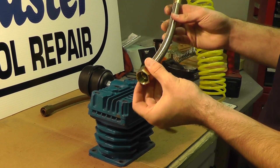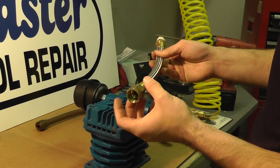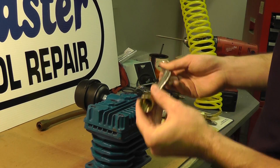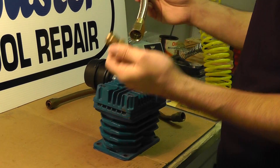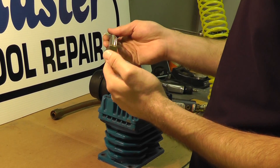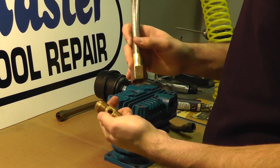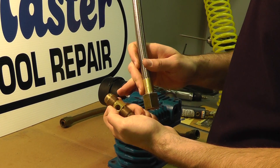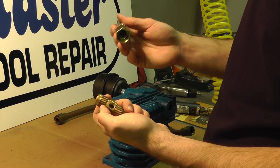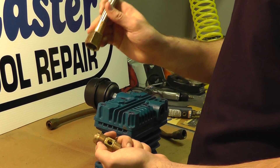And on the end — the outlet here to your tank — the female flare swivel. The swivel obviously, you can see, makes it easy to connect the fitting. You can see it's a female flare type. The tube is actually flared on the inside. And of course we have our five-eighths male flare check valve fitting, which will mate to the transfer tube. Now, you ask why is this half inch and why is this five-eighths? Well, with a female flare fitting matching it to a male flare, the check valve will always — the flare measurement on the check valve will always measure one-eighth inch over. So half inch plus an eighth inch equals five-eighths. It always measures one-eighth inch over the actual size of the transfer tube.